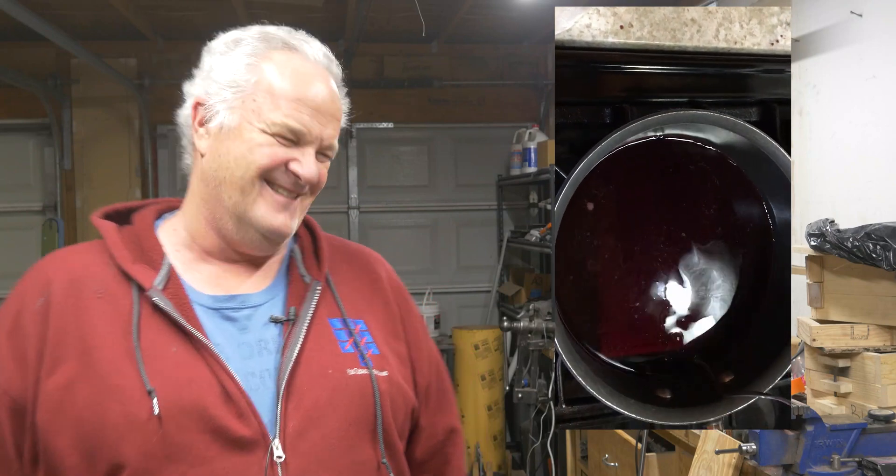My power may have been a little too high. I did the anodizing run, then went ahead and dyed it. I used RIT dye because I saw that somewhere on YouTube. I soaked it and soaked it, keeping it around 50 degrees centigrade — that's about 120 Fahrenheit — for probably two hours. But it just never took. I left it in overnight, got up in the morning, rinsed it off, and it had a slight red tinge. But as soon as I put it in the boiling water to seal the pores, it all came off. So it didn't work.